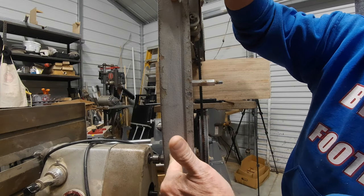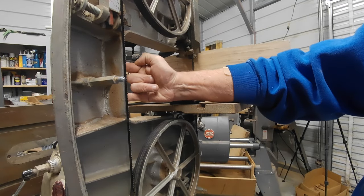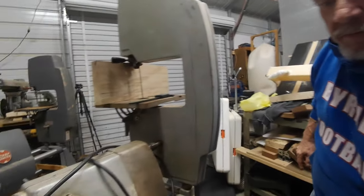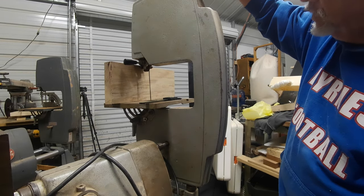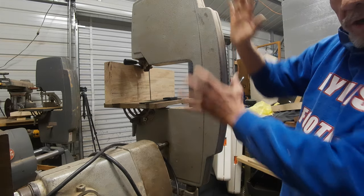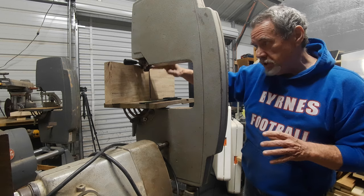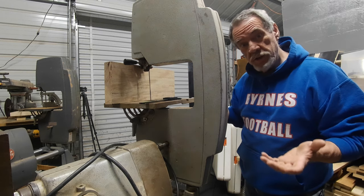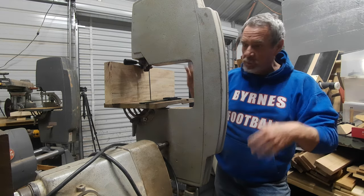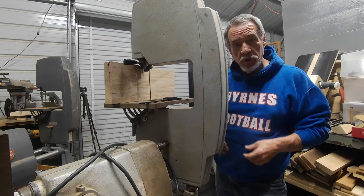Then put the plate in here with bolts, and put a short one inside of here to lock that. If it's not stable enough, I'm thinking about a gusset from here, tied back in here, to really lock it all square and perfect. This saw cuts fairly good, but if I had that extra four inches I could do so many things with my guitar tops. That's all I really want to use it for — just take it out, set it up every now and then, do a guitar top, and put it away.